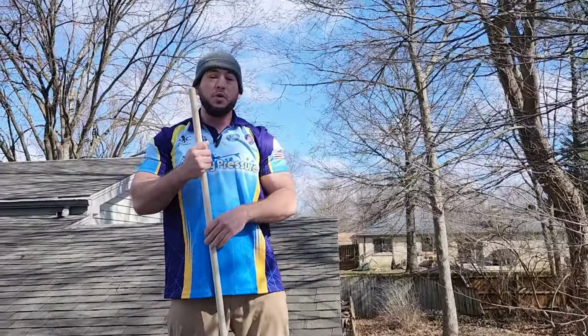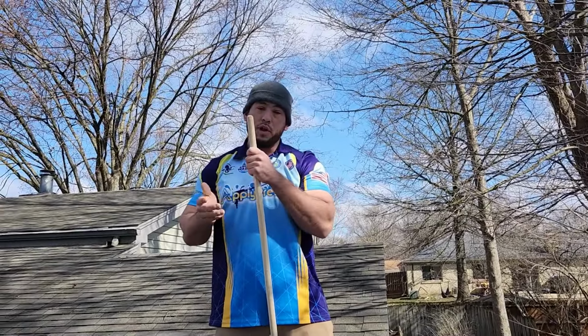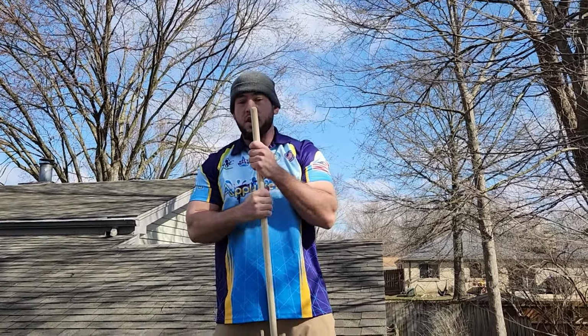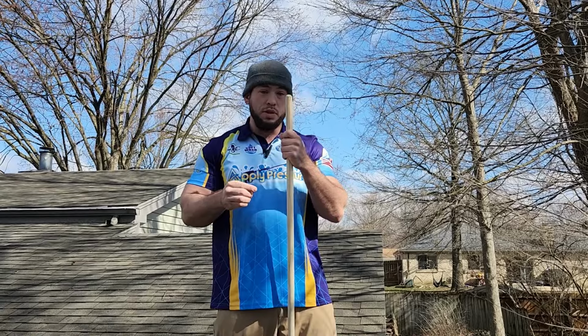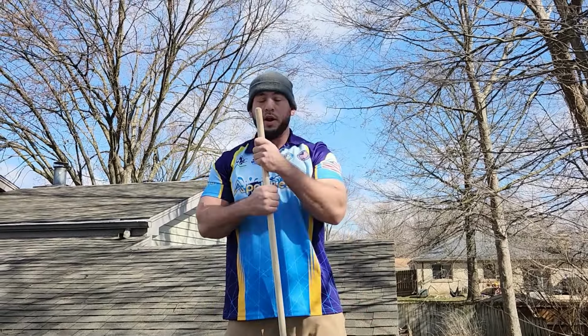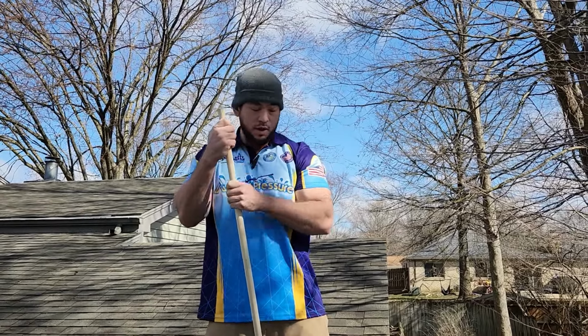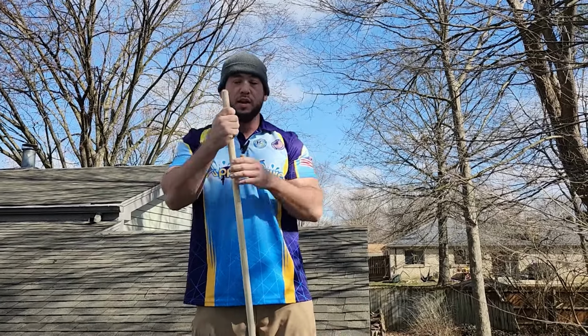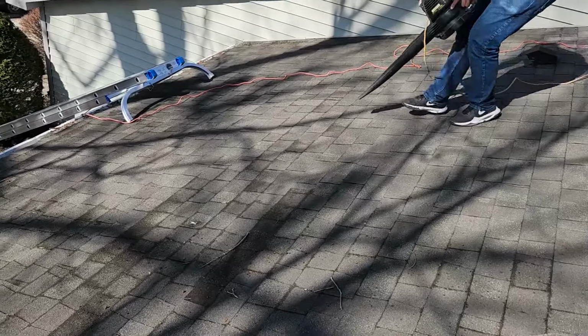Now, if you're on a roof that isn't walkable, you don't want to brush it. The Asphalt Roofing Manufacturers Association recommended process is a soft washing, no hard brushing or pressure washing. So that means if we have mold kicked up on there, we don't want to get on there and apply a lot of pressure. And really, as long as it's dead, the rain will help rinse it down.